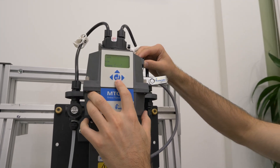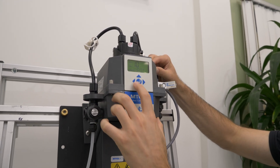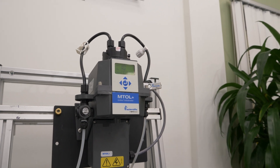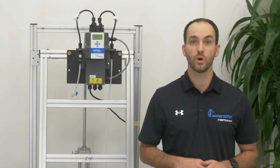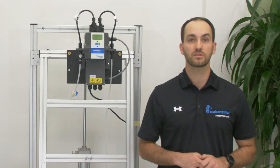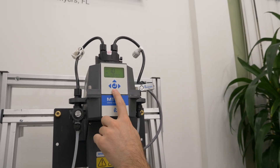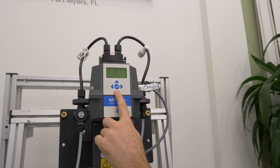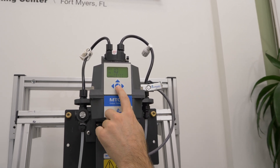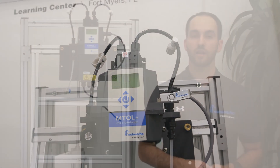Use the down arrow to scroll to configuration mode and hit enter. Use the left arrow to scroll backwards through the menu to the screen which on the bottom says UPDT or update. If there is no USB inserted, the messages in the middle of the screen will say ERR for error. Insert the USB provided with the MTOL Plus and the range which is currently loaded will then be highlighted on the screen. You may scroll to whichever range you want. The ranges are delineated by the top number of the calibration range: 10, 100, or 1000. Once the new range is loaded, the analyzer will display CAL FAIL and a new calibration must be performed for the analyzer to work.